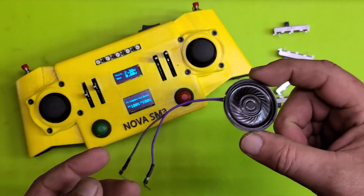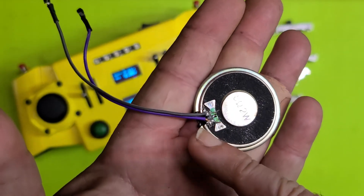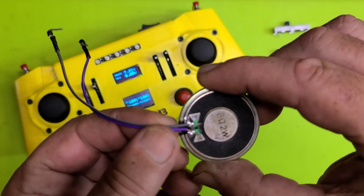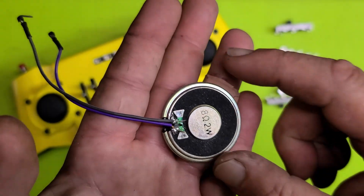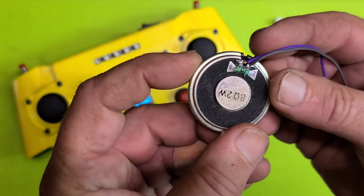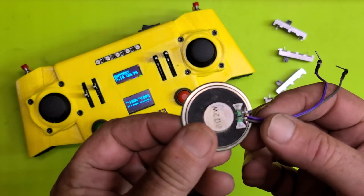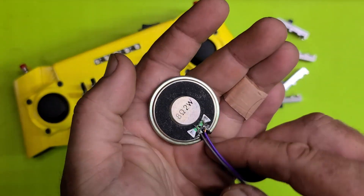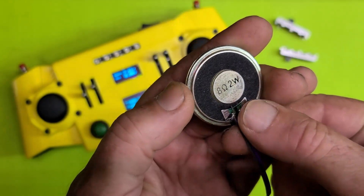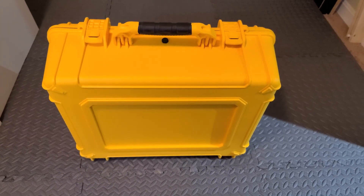It turns out these cheap little speakers that come with the MP3 players are pretty much useless. I don't know how many times I've broken the pads on these speakers and tossed them in the trash — they're just so fragile. If you heat them just a little too much when soldering the wires on, you're out of luck. So I upgraded a tiny bit: I can't show the one I have now, but it's the same diameter, a little thicker, and about three or four watts. The sound is a little better, but more importantly the pads on the speaker are better. It wasn't my MP3 player at all — a couple months back when we were having issues, this could have been the culprit, because they don't have to break clean off to lose connection.